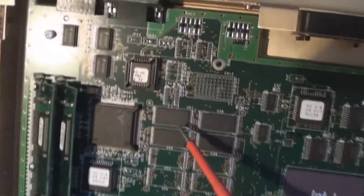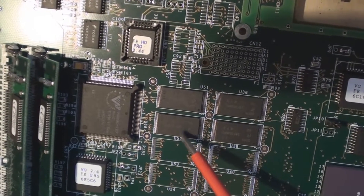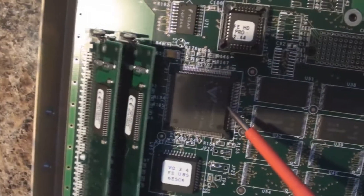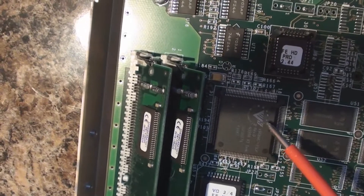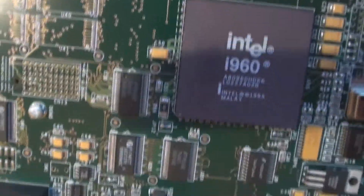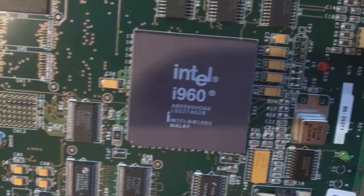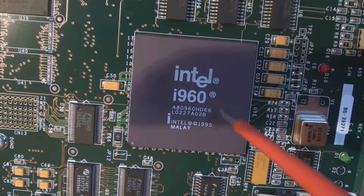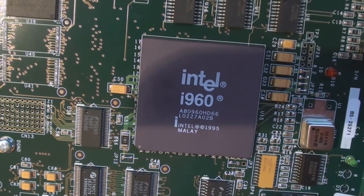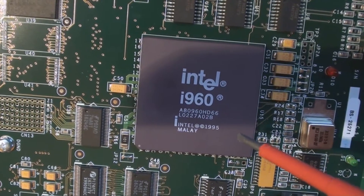Over here we've got some memory chips that look like flash memory to hold the operating system and all the software. We've got another chip here which I'm not quite sure what it's for — I don't recognise the part number. It's copyrighted 1996 and it's made by V3 Semiconductor, so it's a bit unusual. Now, as we come across here, we find the brains of the operation, which is an Intel i960 processor running at 33 megahertz. These are very common on SCSI controllers and things like that — things which require just enough processing power to get through. Even in the year 2000, the 33 megahertz i960 would have been more than enough to run this.